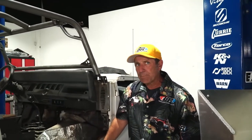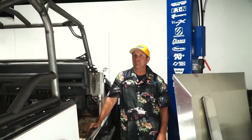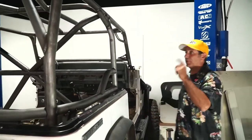Okay. Kane Grove says 95 YJ. What gear ratio would you recommend for a 2.5 with 35s? So you're going to be 456 or maybe even want to go to 488, but definitely 456. Okay. All right. Next option, roof.